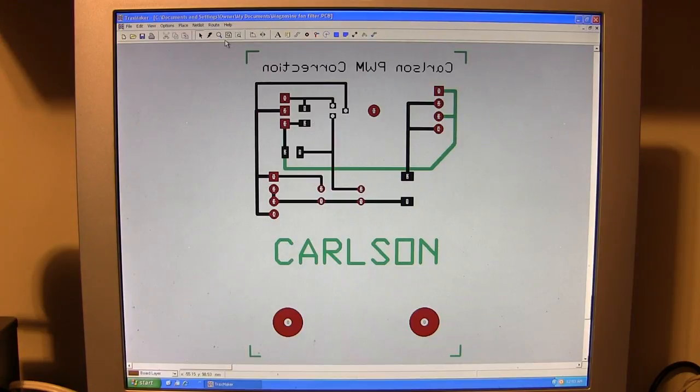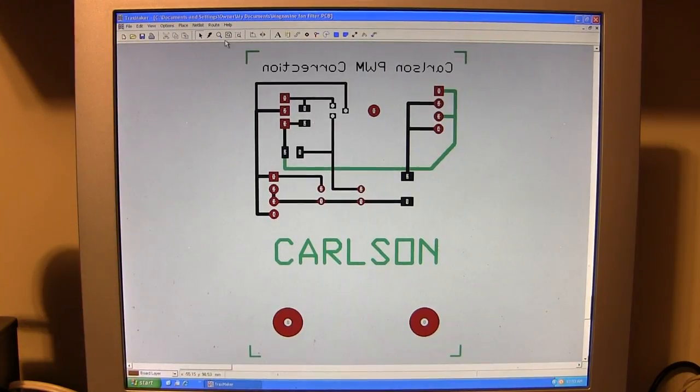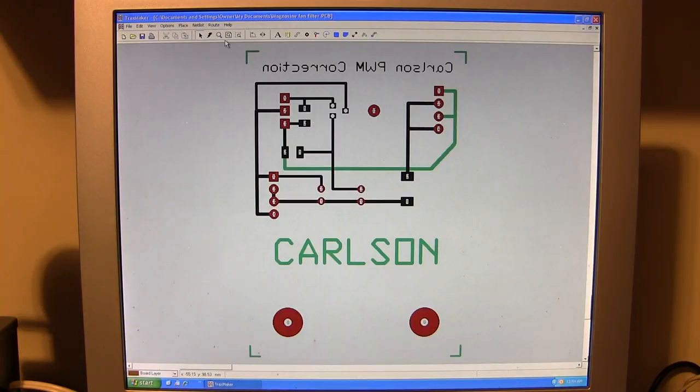The toner cartridge in a regular HP laser printer — I got an $80 HP laser printer from Staples — comes with a trial cartridge with about a quarter toner. That lasted me two years of making circuit boards because really it's only a small amount of the paper that's printed. When you're doing RF circuit boards with a lot of fill, like ground plane layers, you'll go through toner faster. But for most cases when you're doing circuit boards like this they last a long time. The printer is off all the time — I only turn on my laser printer when I build circuit boards. Everything else comes out of my wireless ink printer, an HP OfficeJet Pro 8600.